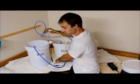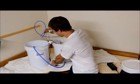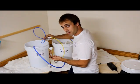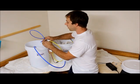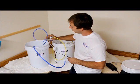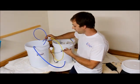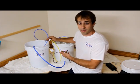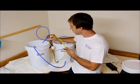We have good flow. What I'm going to do is quickly unplug the transformer, plug in the end of my low pressure switch, and plug the other end back in to my transformer. The unit should stay on. If it doesn't stay on, you didn't do it quite fast enough, and you're going to have to repeat the procedure doing it a little bit quicker.